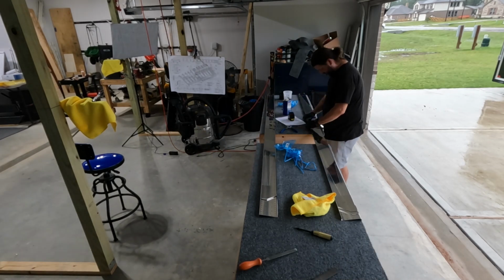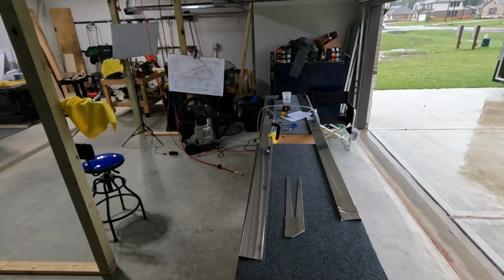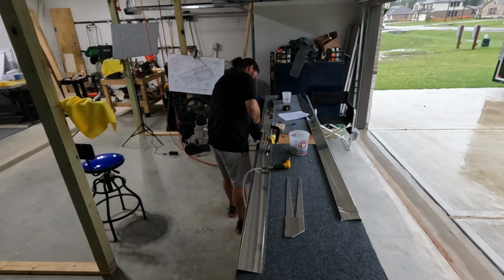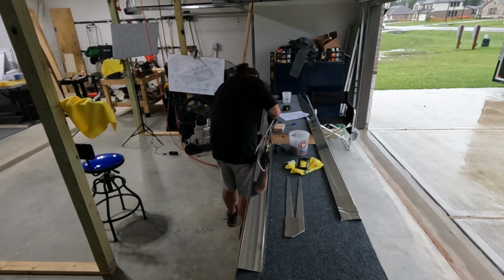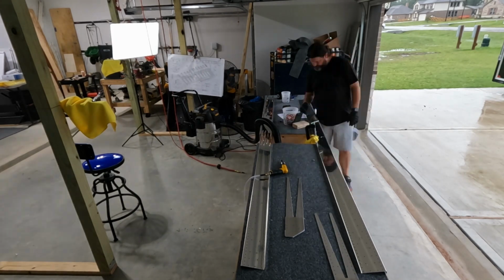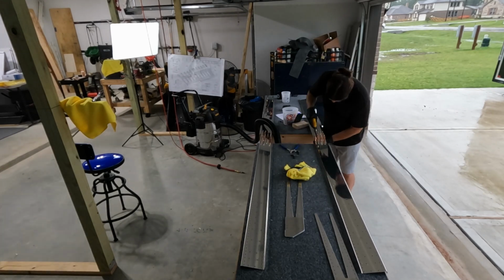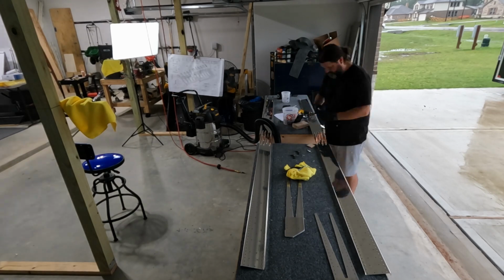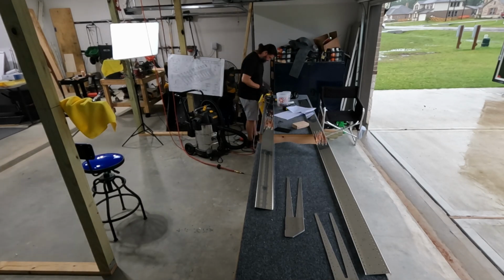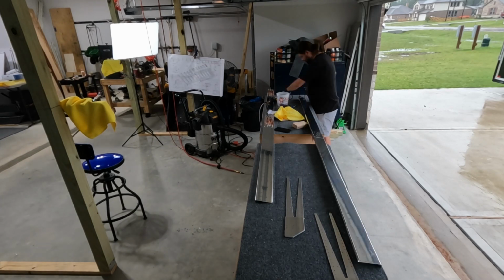What you see me measuring there is the inboard or mid-wing doubler right there. It's measured a very specific distance off the end of the spar. I don't remember exactly, but I think it's near 40 3/4 inches. What that doubler is going to do is provide some extra meat where the aileron attach bracket is going to mount. And so these doublers are blank. As I recall, they don't have any rivet holes in them, so the end one is pretty easy because you match it so that it's flush with the end and that the flange of that mates against the flange of the spar, and then you use the spar as a drill guide. Obviously, the spar is a drill guide for the mid doubler. You just have to measure precisely to put it in the correct position in the middle of the wing spar.